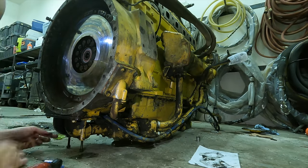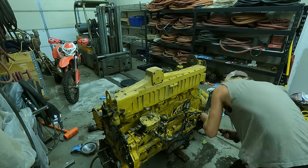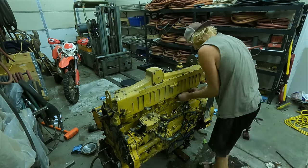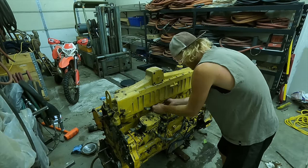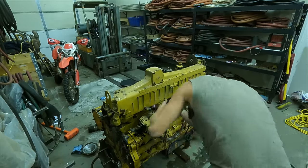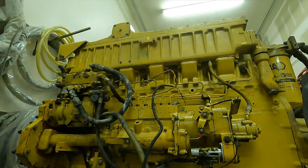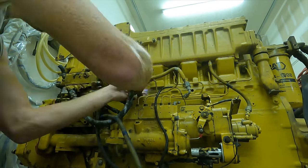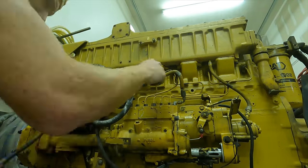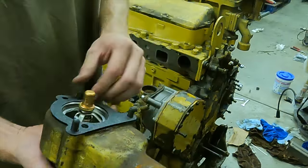Here I'm placing all the individual gaskets for the intake manifold, which is also a water-to-air intercooler to cool the pressurized air from the turbo — cooler air is more dense, so the engine makes more power. It's held on with a ton of bolts that feed up through the bottom into tight places. This is a tube that returns coolant back to the engine after it flows through the intercooler. This little manifold organizes the fuel return and feed lines, hooking up to the injection pump and fuel pump.